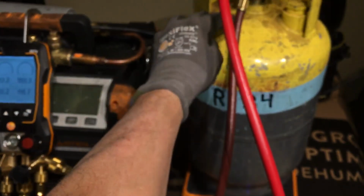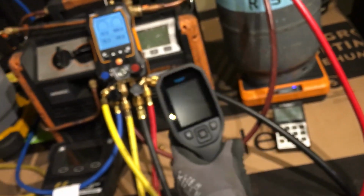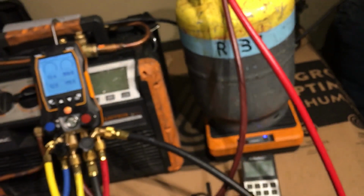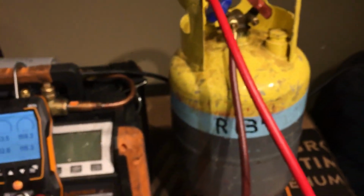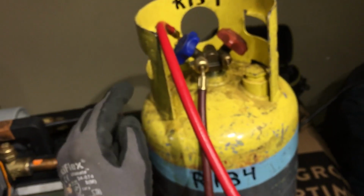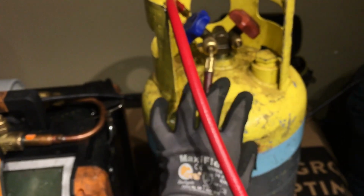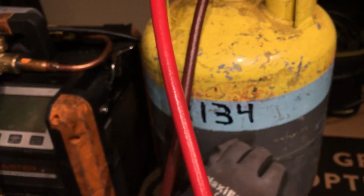You would see this whole tank from the top all the way down get red inside the thermal camera, and the entire tank would be 140 degrees. But because I already started out with a cold mass in there, that was the only reason you saw the lower blue and saw it get all hot up here, because there was no cold liquid up here absorbing the hot vapor going into this tank, and the little mass of the thin metal of the tank was actually getting hot up to the level of the hot vapor.